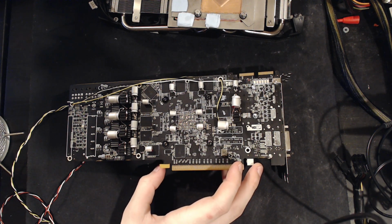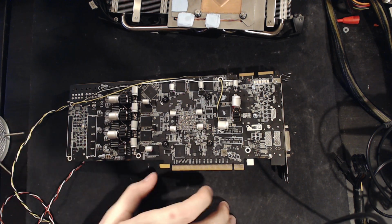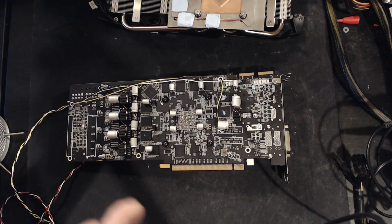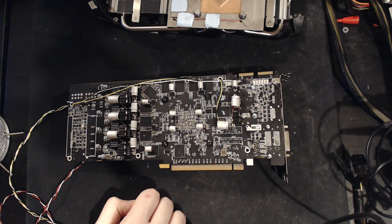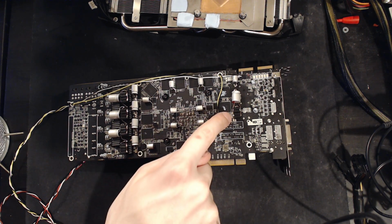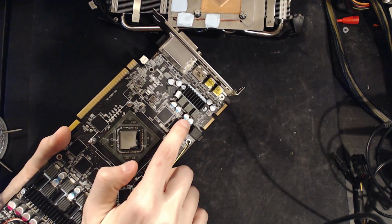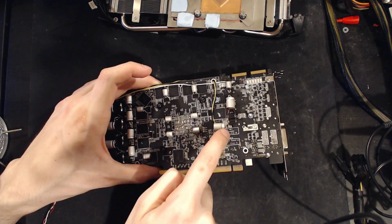The card was hitting that before and after. Well, I don't know if it was hitting that before on the water cooling, but I know on air cooling it was doing 1930, and when I added the capacitors and was still on air cooling, it still did 1930. It didn't pick up a single megahertz. So I'm surprised. The memory VRM is actually not bad out of the box, even though it's a single phase, because those are usually terrible. But then again, Sapphire have gone ahead, and you do have 2 capacitors coming off of the VRM itself, and then you have tantalum capacitors, basically for every 2 memory chips.